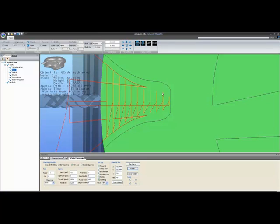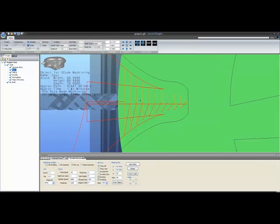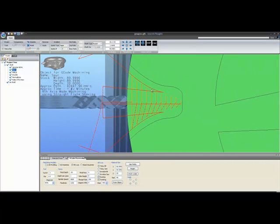This kind of tells me right there that if I want a really fine resolution of the root, I would almost have to clear it with a 2mm or maybe 2.5mm bit. Anyway, this is one of the things that you should watch out for. As you can see, as I go up in diameter of the bit, my tangential points get further and further away from the actual tooth of the gear, which is as you would expect.